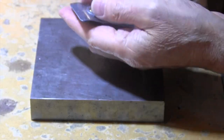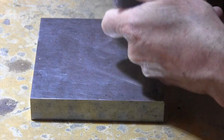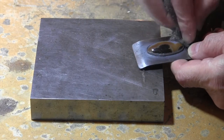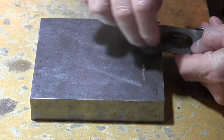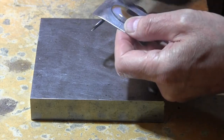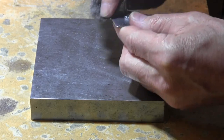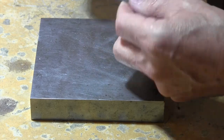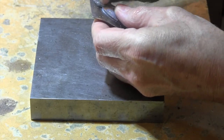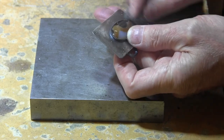Oh, I forgot. When you're using gallery wire and steel wool, you're going to have a little bit of grabbing of it. You can see there. But, okay, so just take your time, kind of swirly motions. I want it to start to remove quite a bit of the oxidation. I did forget about the issue with gallery wire and steel wool. We're going to have to pick at it and get those things out of there. You can see how they're grabbing.